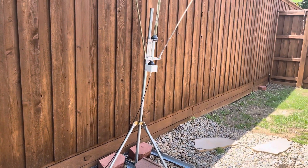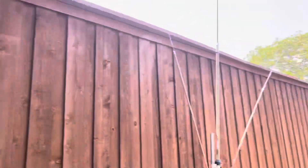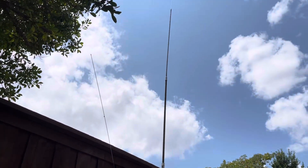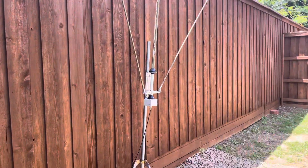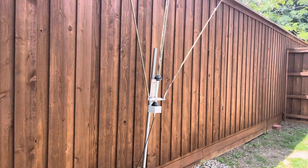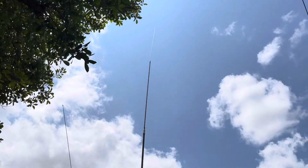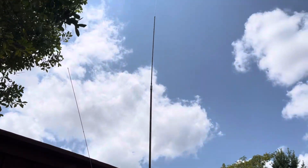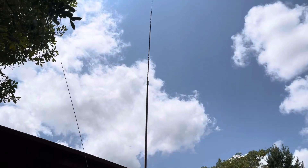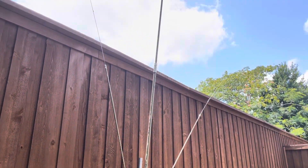It's an option — I have some other wire antennas here, but it's fun to have a vertical. I have another vertical here about 67 feet, but it doesn't cover 160, 80, or 40, or even 20. This Sigma is resonant at 20 meters out of the box, and there are days when you get on 20 meters and the DX is flowing — if you have that vertical and that low angle takeoff, you will outperform a beam. Trust me, it might not make sense, but the results are in the logbook.